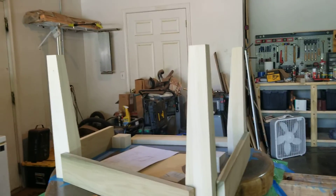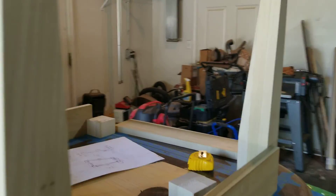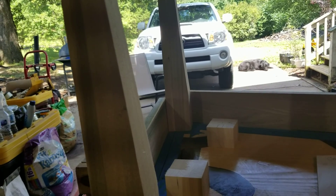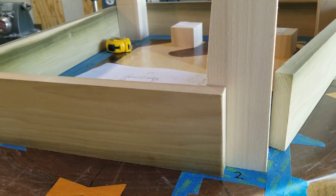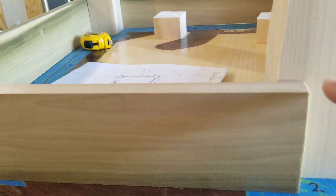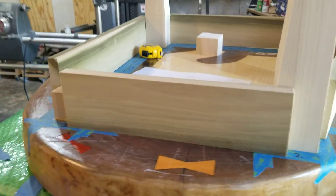Getting the legs cut took a couple of hours to figure out. This here is the apron — it's going to run along the base. You'll notice it's cut long compared to the legs, and that's because it's going to have tenons in it. The mortises are cut in the legs and the tenons fit into those — so there are mortise and tenon joints on there.